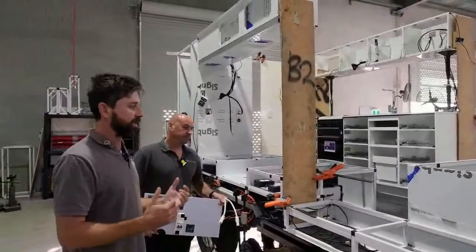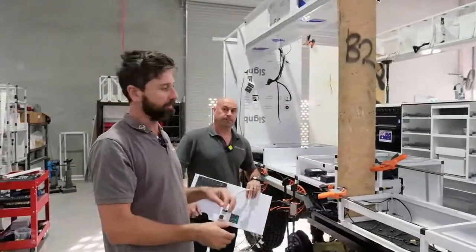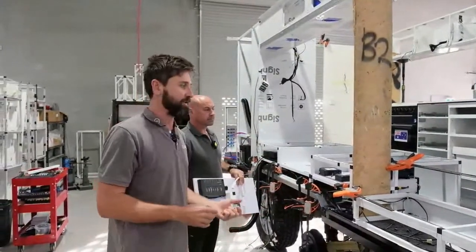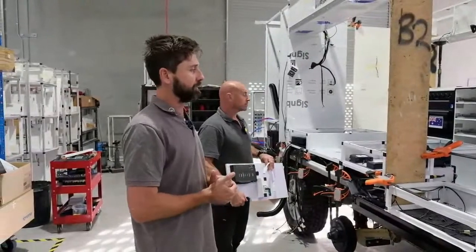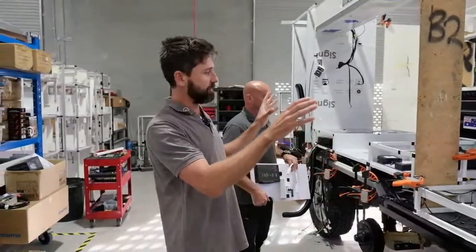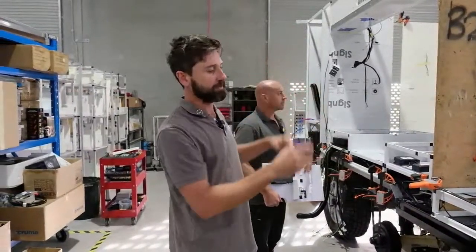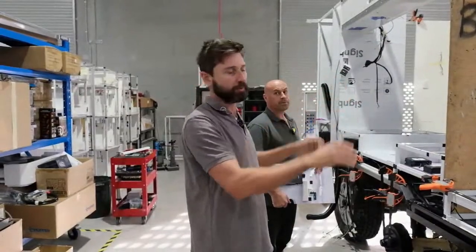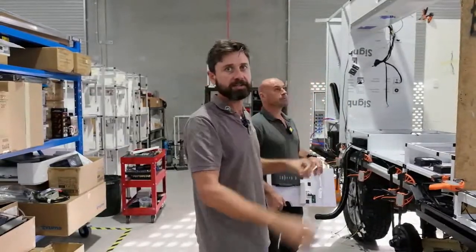Now, it is a really key thing for us, bonding this furniture to the floor as opposed to rolling your vinyl flooring through and screwing furniture down through the vinyl flooring and into a floor panel, which is what most people in the construction industry would call a floating floor. And a floating floor is not what you want in an off-road caravan. We want all of this furniture firmly bonded to the floor, and then bonded to a sidewall or a roof wherever it's coming in contact. And it is that whole integral structure of the inside being firmly bonded to the walls and the floor that, from an engineering point of view, really locks these things up.